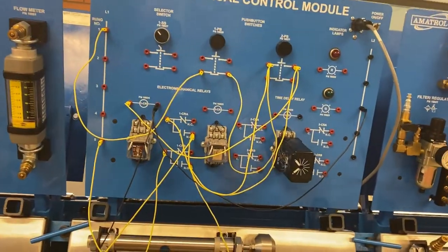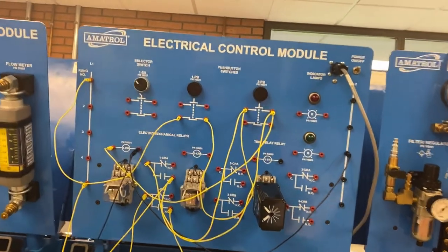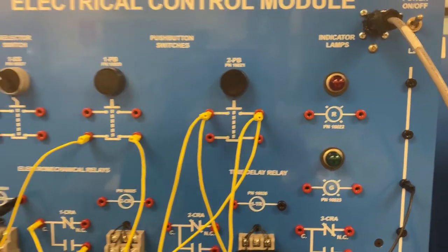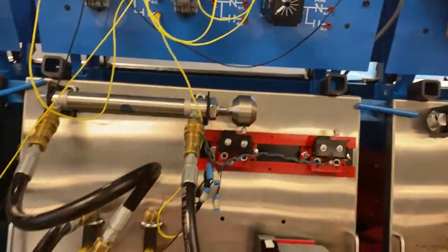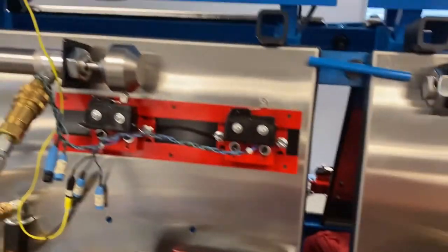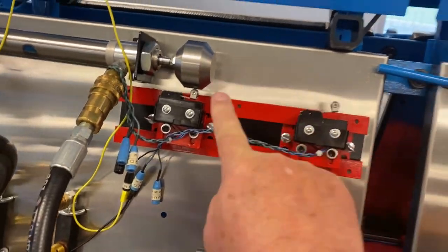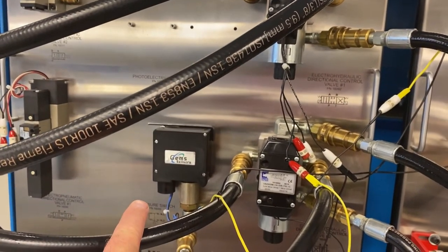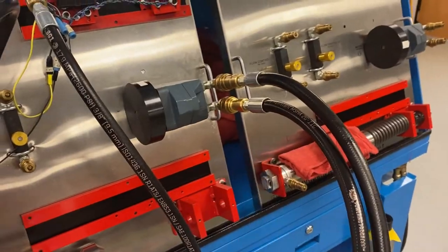Here's a bunch of wires, but it lines up with the wiring guide I just posted for you. Here's our stop switch wired into our start switch, which is also sealed in. Here's our control relay — we're only using one relay; relay B is not being used. When we get down to the hydraulics, we've got this rod being controlled by this DCV. The second step doesn't work until the rod extends and closes this circuit. Once this limit switch gets closed by the rod being activated, that gives this pressure switch the opportunity to read the pressure. When the pressure builds up, this switch allows the other DCV to activate, which will then run that motor.